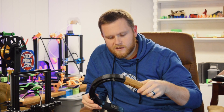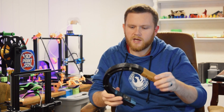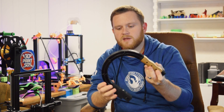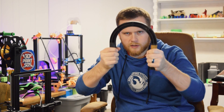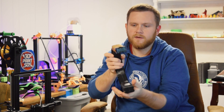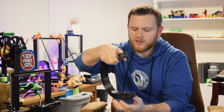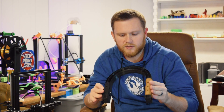However, I'm no engineer — I'm a beginner in designing things, although I've been doing it for a while. There were a couple of things I overlooked on this design. Basically I made this portion look like it was machined, and what ended up happening is this design makes it really strong in one direction — you couldn't even flex it — but in the other direction there's way too much movement for it to be a reliable mount. That was just because of aesthetic, something I didn't even remotely consider.